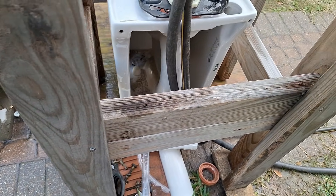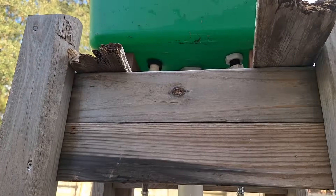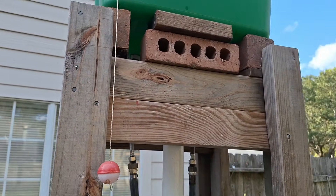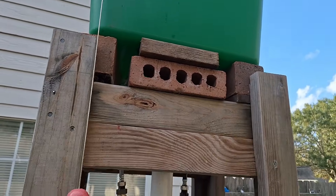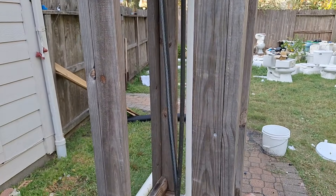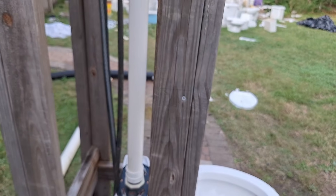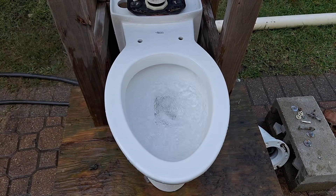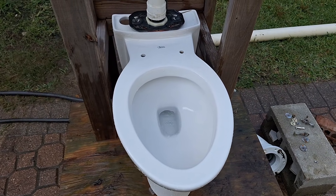Up here I use two two-by-fours on each side because this area directly supports the 18-gallon tank and you don't want that to break. I put screws in both down here and up here to make sure nothing falls down. To adjust the height of the tank — since you don't want to cut the pipe — I use leftover scrap wood and bricks, because some of my toilets are comfort height, some are standard height, and I even have a baby toilet. I'll include a picture of the block structure at the end so you can see the general shape from the top. Now let's give this a flush — it puts some real power into these toilets.